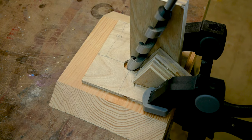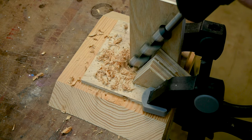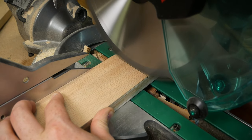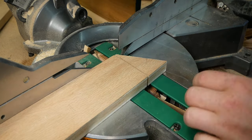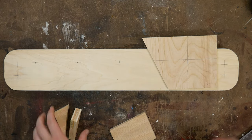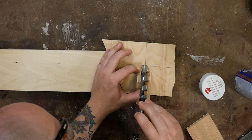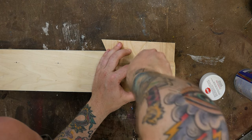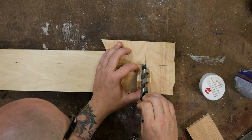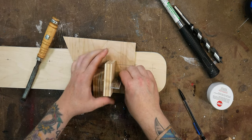For those of you that don't have a drill press but still want to drill accurate repeatable angled holes, I got you. Cut two triangles at the correct angle with the saw of your choice and glue them together. Mark on a squared piece of scrap wood where you want your hole to go, then place the tip of your bit on that mark and tilt it, moving the bit and triangle block until they're flush. Glue it down, then add a fence to keep the bit straight and you're good to go. Eventually this will wear out but it'll get you by in a pinch. The marking lines will also help you line up your jig for drilling.